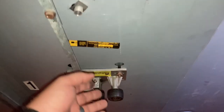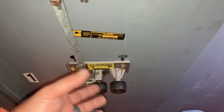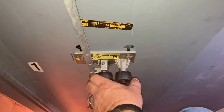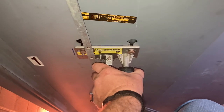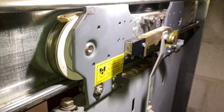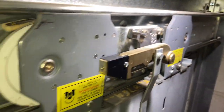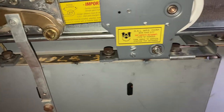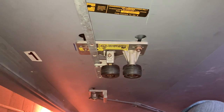Just to finish this off — the clutch on the car means you can never have something malfunction where a door opens in the hall with the elevator not there. You need the elevator clutch to come here, tap the beaks, pick up, clear the door lock, and open. Then obviously to run, you need it closed and the contacts bridged in here. Hope that helps — thanks for watching.